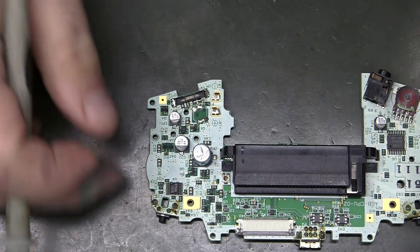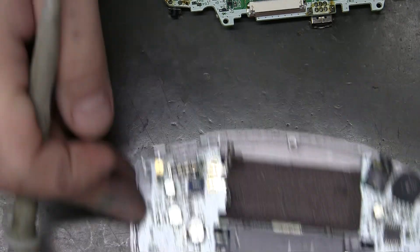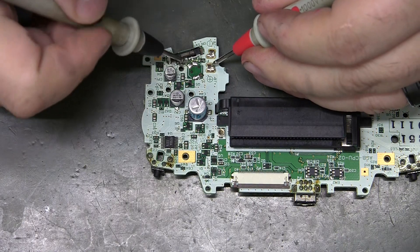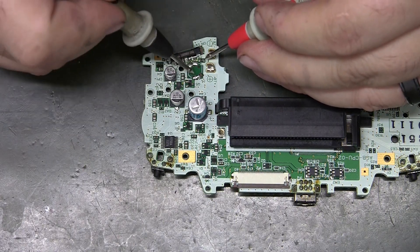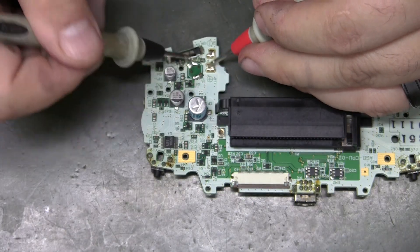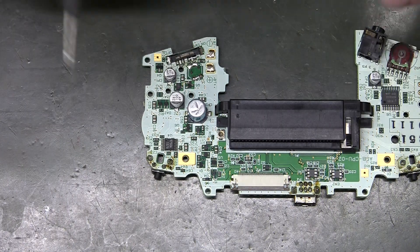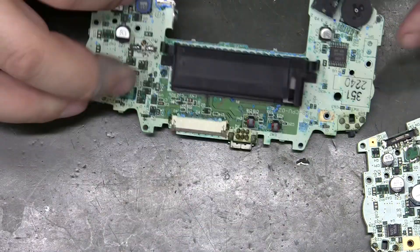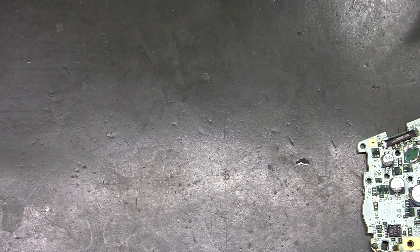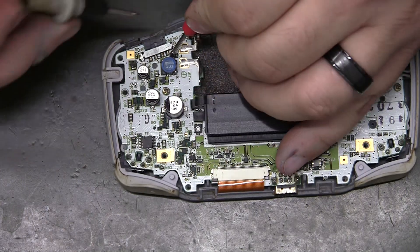Another interesting tidbit about the power switch bypass: I was so worried about my solder blob going over to the inductor marked L1. I wondered if those pads were connected anyway — and it turns out they are. It's a surface mount component with two pads, and it means you can connect the left side and right side of the fuse right to that inductor. I'm going to find another motherboard that hasn't already been bypassed.